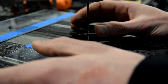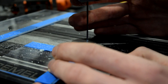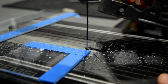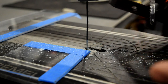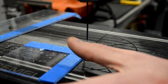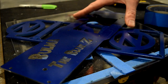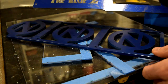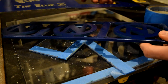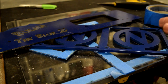I do love the smell of fresh cut plastic. It might have been hard to tell, but I used a higher speed setting on the scroll saw here — I would do the same with the jigsaw. Overall I've had the best luck with it. However, you can fine tune most of these saws to have different speeds if you are having issues with the plastic melting or the cut not turning out quite right.